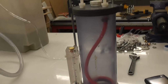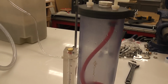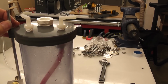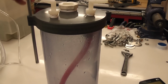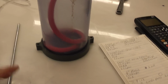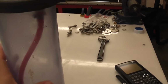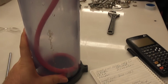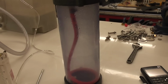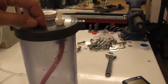It's not cheap. We have our new style bubbler again here that is much better than our old one. The other one to me was not pretty. This one we designed, and we build these, and they come in a variety of sizes. This bar here is simply just to hold the meter up. It doesn't actually go there, but you can mount it however you want, and it's not real expensive. We could make them cheaper if we use opaque PVC, but people like to see inside there, so do we. Also, these bubblers come with a check valve that goes on the input side to the bubbler.